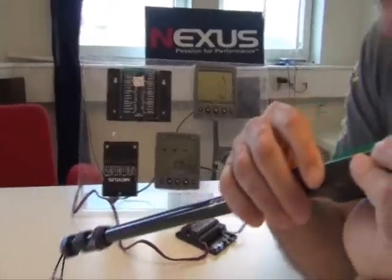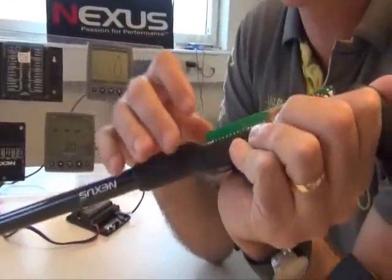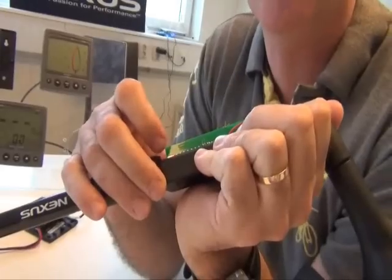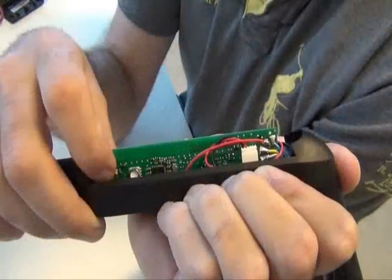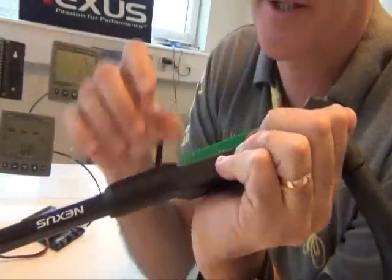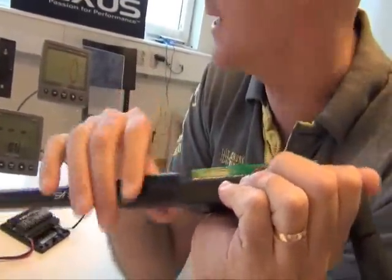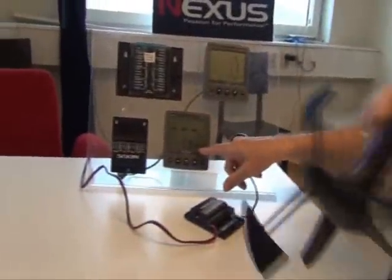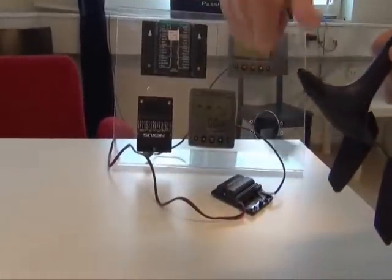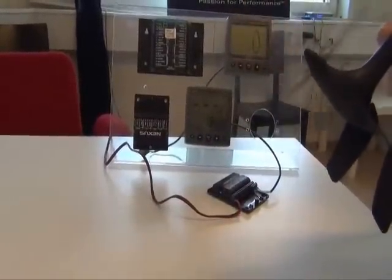Next, we go to our wind transducer, and to couple that with the available WSI box, we simply press the button here, one short burst, and it should give us two flashes if everything's okay. And as you see, the light flashed twice there, so everything should be okay. But if we come back to the WSI, the C data instrument here, give it a quick turn, you'll see that we've got wind reading straight away.